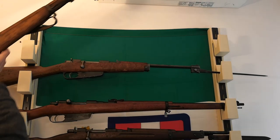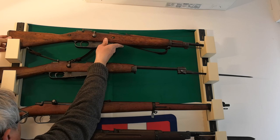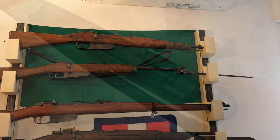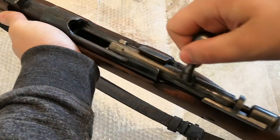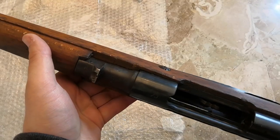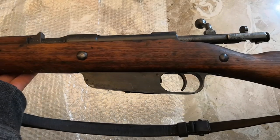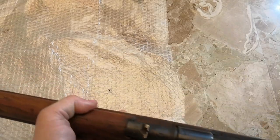Finally, after the 1943 armistice of Italy, another last version was made. The occupying German forces ordered in 1945 the conversion of some of the existing rifles and carbines to the 8mm Mauser calibre, and you can see an example in the utmost position on the rack — a 91/38 carbine converted to chamber the 8mm Mauser. The most visible change regards the two pins in the stock used to reinforce it against the stronger recoiling German cartridge, and a few others had to be made to the action in order to handle the larger cartridge. The fixed magazine now only holds 5 rounds using a different clip, and a few parts had to be machined out to make room for the bigger ammunition, decreasing the metal thickness in many points and hence the strength of the weapon.